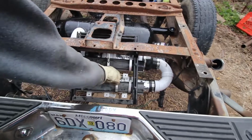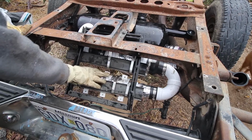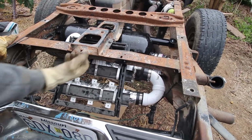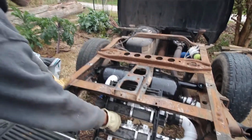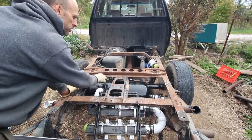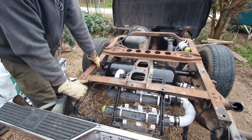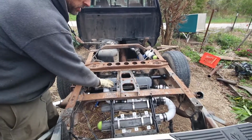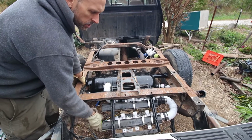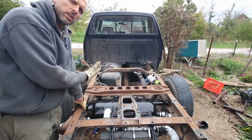Behind this unit, these are fans. These are actually bilge pumps, so they're water resistant 12-volt bilge pumps that are used to draw air through the gasifier. This is before the engine starts. So we have these fans here that suck air into the condensate tank to simulate the draw of the engine. And then once the engine starts on the wood gas, we close this tennis ball valve to make it airtight, turn off the fans, and then the wood gas is being drawn through the system by the vacuum created by the engine.